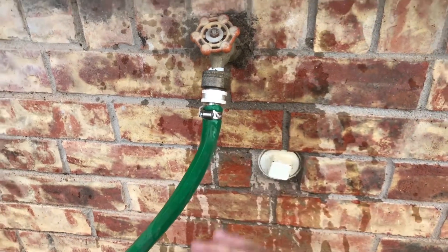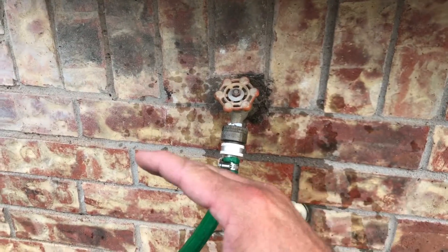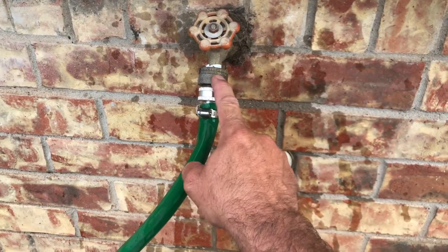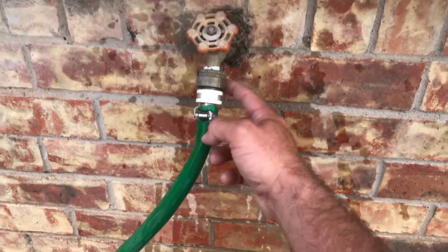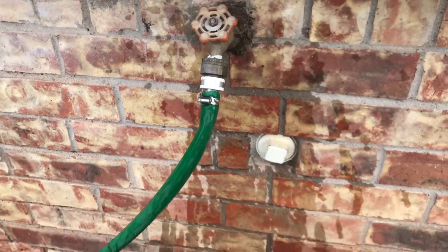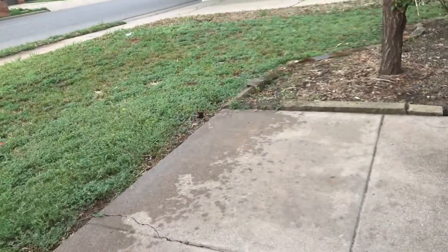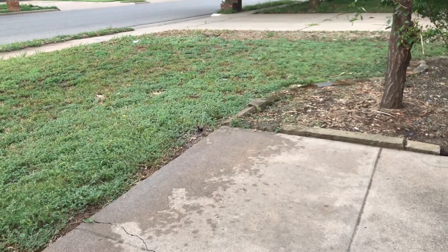The answer is yes — when I shut this off, you see that? It works exactly like it's supposed to, because when those heads go down it's pushing water back, and it actually pushed it back up this hose. But this backflow preventer kept it from going into the house, which could be a potential problem. I can show you again — I'll turn this on from this view.